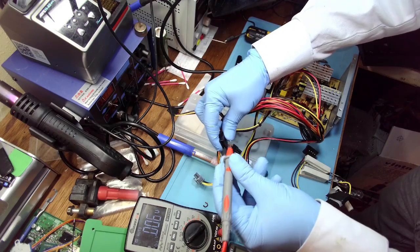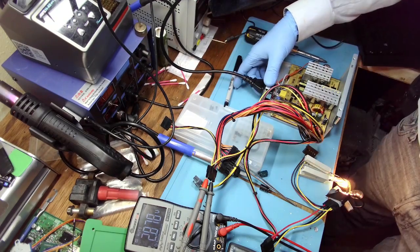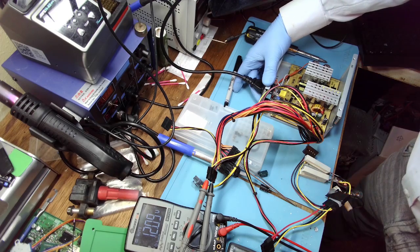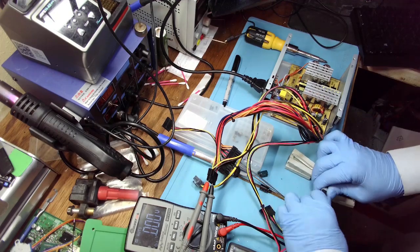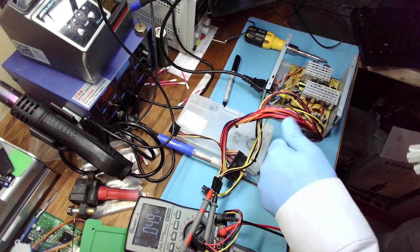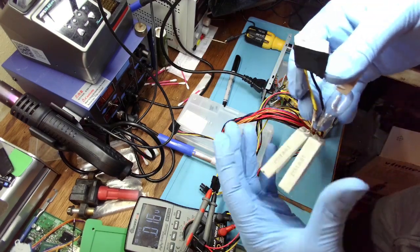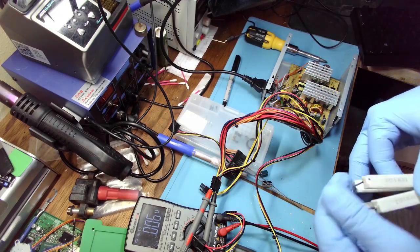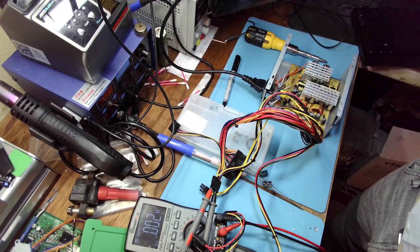And let's see on the different wire. So this is the separate wire. Drop over here should be significantly less. 12.07 from 12.09. Yeah, so basically no voltage drop. And this heated up very well. Oh, and the cables here are hot to the touch. Well, not hot to the touch, warm. These are hot to the touch. And if you let them run for a minute, they'll just burn. These are rated for 10 watts, and I'm using it as like close to 200 watt load.